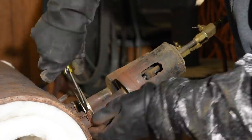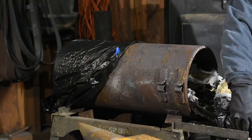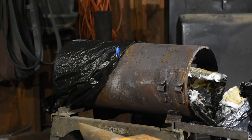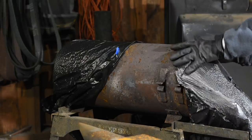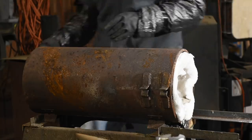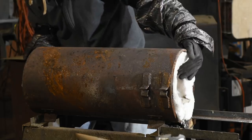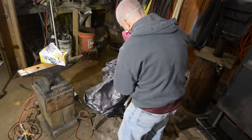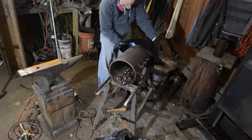The first task is to remove the burners and pull out all the old stuff. You'll notice I'm wearing heavy rubber gloves and a respirator. Now this stuff's not asbestos, but it irritates your throat and your skin, so I'm as cautious as it's practical to be. I also have garbage bags wrapped around my arms — it does a pretty good job of keeping my arms from getting covered with itchy fibers.